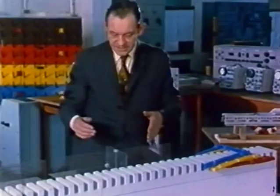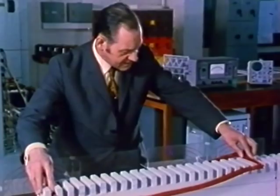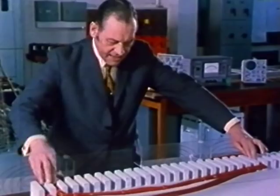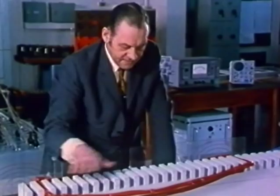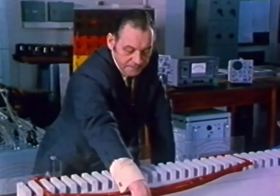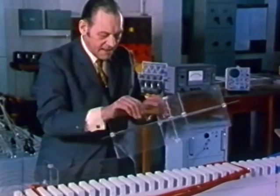Just imagine how these problems would be magnified when you have to deal with coils four foot six long. You'd be putting one end in a slot over there and the other one four foot six away — and this end winding would have built up to something quite impossible by the time you'd filled all these slots. And that's as far as the electric circuit is concerned. Magnetically, all the magnetic flux through these teeth has got to find its way back up the core, so the core has to be very deep. And so it seemed for a long time as though it was going to be absolutely impossible to design a 250 mile-an-hour motor to be fed directly from the mains — and yet not to use the mains was going to be very expensive. And then we started to think about shape first and the motor afterwards. We realised that all the motors we'd been making could be represented by a shape model in which the magnetic circuits are in vertical planes.